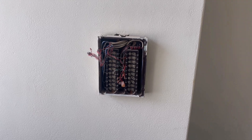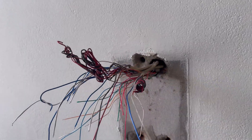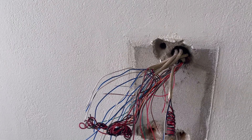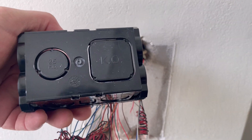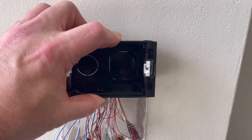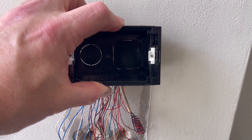I've pulled the IDFs off - there's a whole bunch of them, like six or seven. We're going to fit these wall boxes in. They've got these knockouts here, so we're going to get a measurement and I'm going to trace around where this is going to go, then chisel out the wall and fit these in.